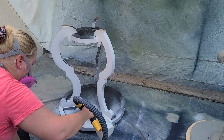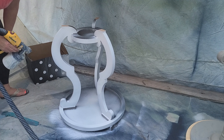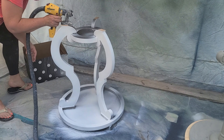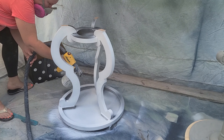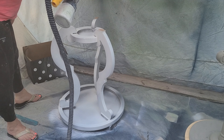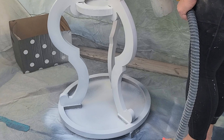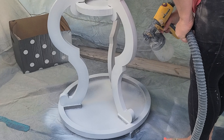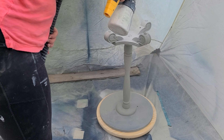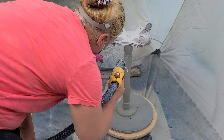As you can see, these are completely different heights, so we need to level these out. The first thing I did was cut off those little tips at the bottom of the larger table. Then we're going to give it a good cleaning — I got my White Lightning out, gave it a good scrub, then rinsed it down with clear water and wiped off all the residue from the cleaner. Another way to level this out is to make the smaller one a little taller, so I'm adding an 18-inch wood round that I got from Lowe's. I'm going to glue it first and then screw it into place.